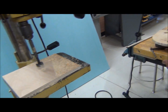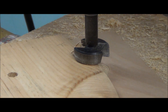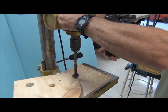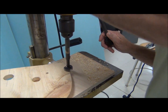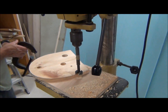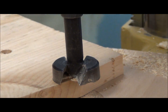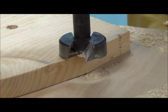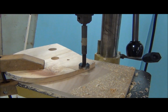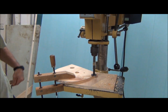Do you want to show them a half a circle? Sure, that'll be fun. This is why a Forstner bit has an advantage over other bits — it's more able to cut less than a whole circle. The Forstner bit is less dependent on the center of the bit. Like the spade bit would be really difficult to grip the wood and make that cut if you don't have a full center. So we're going to cut a half a circle, and if you tried this with a twist drill, you'd probably have bad results — marginal at best.